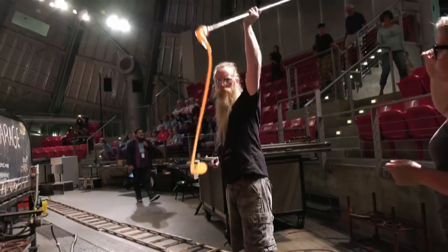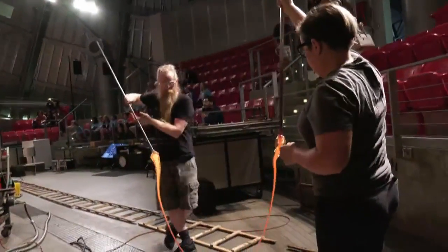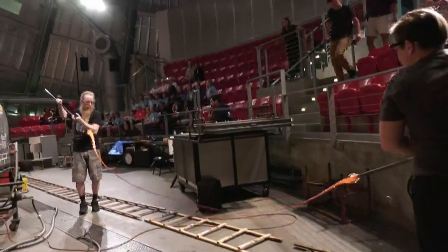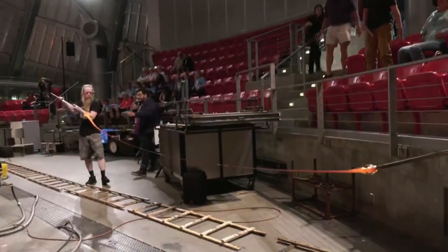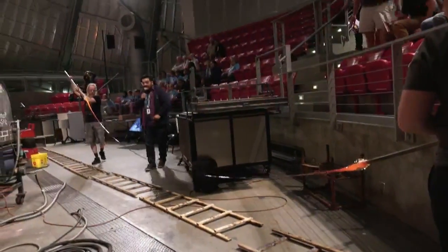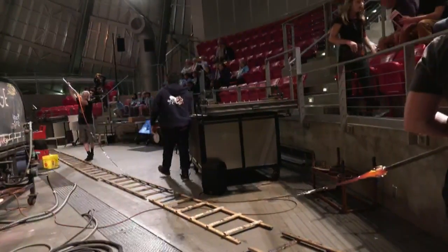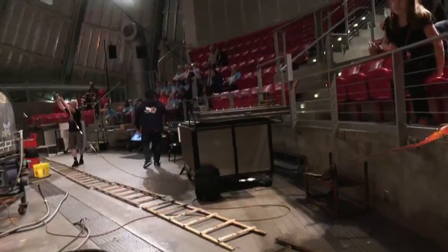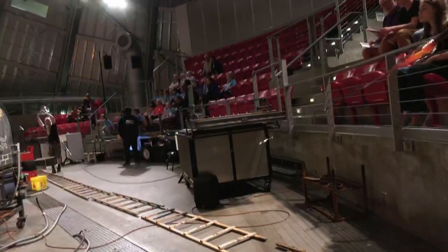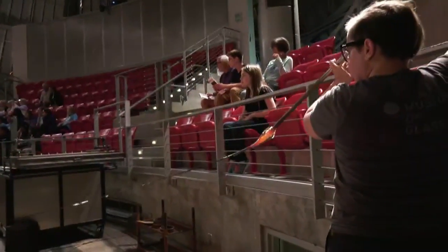I had said that we're going to be stretching the massive glass, and here we go. We have Courtney. The initial pull that you saw him do, that is determining the length or the diameter of these canes. Now, mass likes to hold heat, so notice that this end is where that red and orange is still located. This is where the length is being pulled from, but everything down here in the center is already cool. We're not manipulating this any longer. Rather, all the length is being pulled out of this hot end since mass likes to hold heat, and this is all theoretically physics. Isn't that amazing, though, right? It started off as a blob, very similar to taffy making.